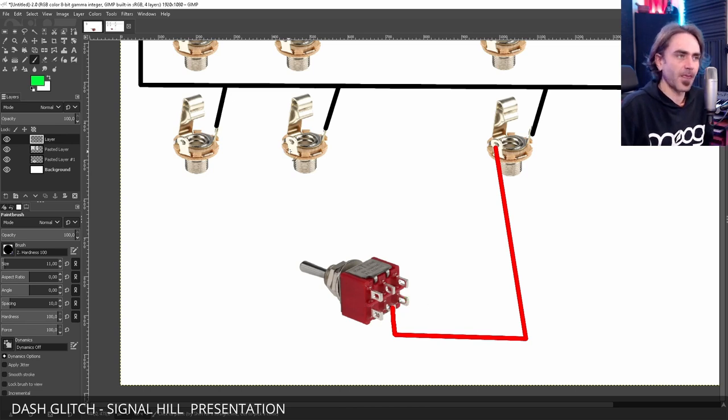It's a bit weird, but that's something I actually messed up the first few times I made switches. I had to resolder them anyway. I actually broke a couple of switches because you've got to be really quick with this. Because of this plastic, it melts really quickly. You've got to solder these little connectors really, really quickly. So buy a couple of spare switches if this is the first time you're working with these kinds of little plastic switches. Just another thing to bear in mind.